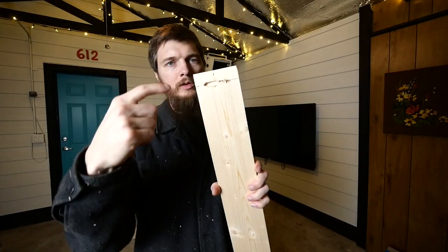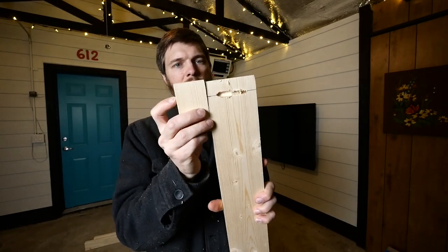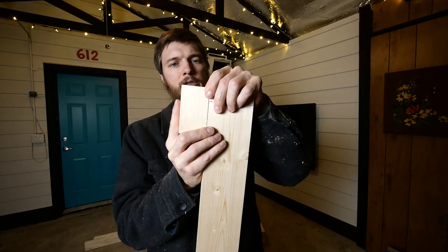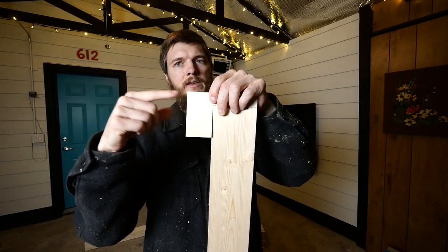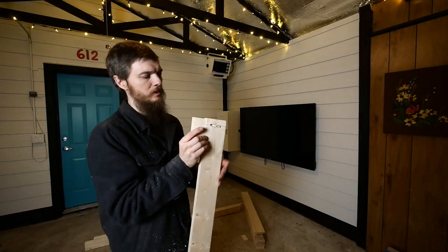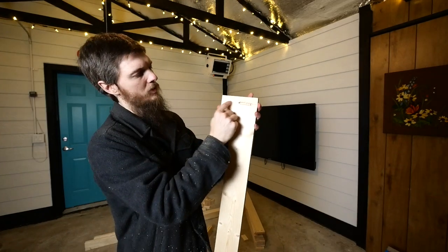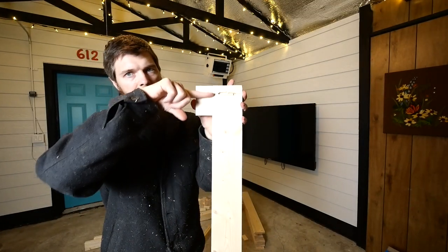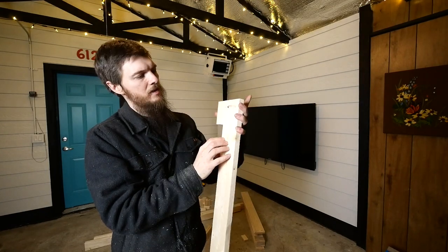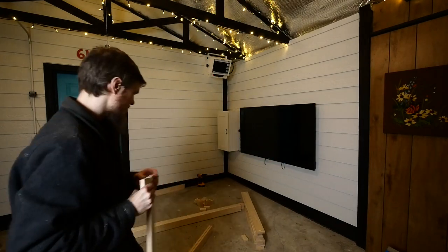I got a pocket hole drilled this way and one drilled this way, so two on each end. What I'm going to be doing is attaching these little blocks of wood like that — glue, screw it, put the next board up, screw it into this way. It'll make sense. We're going to make a solid platform. We did this on a previous bed and it worked out really well. This time a little bit different. The holes are offset — they're going to be up here. I'm not worried about down here because it's going to be sitting on the bed rails. That's the process — just pocket holing all these little chunks of wood and slats all together.